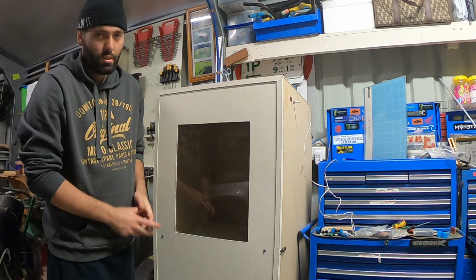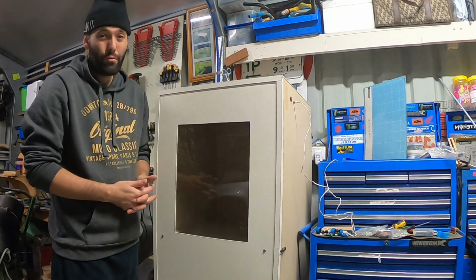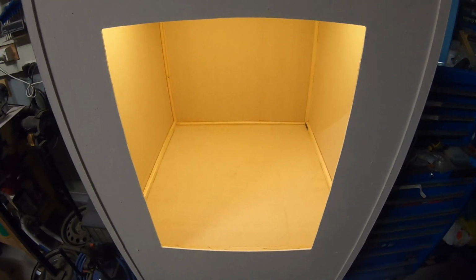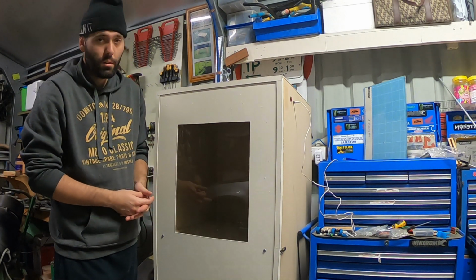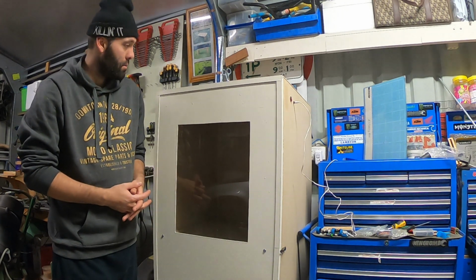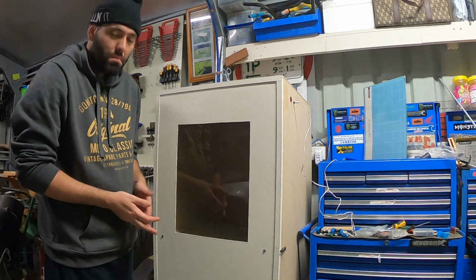The light is just a cheap eBay LED strip that you can get from China, from overseas, for about $3 for about 5 meters, which is super cheap. It just runs off a 12-volt toggle switch wired into a 12-volt power adapter. That way you can plug it into the wall, and it does a really good job of powering it up. So that's really it. And I've actually got my cabinet sitting on a metal frame, which works.